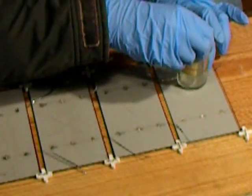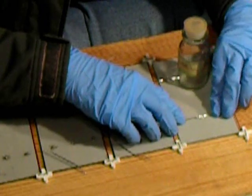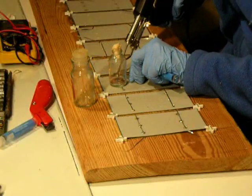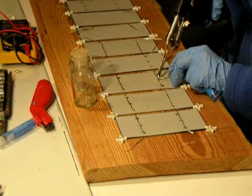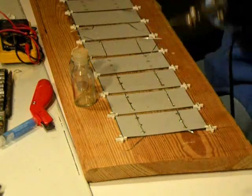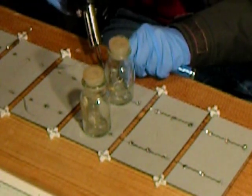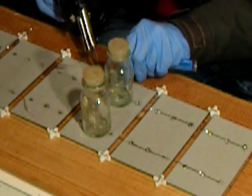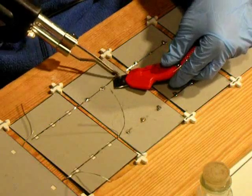Use weights to hold down the tab wires from the front of the cells over the white squares. Use glass weights instead of metal because the soldering iron acts as an electromagnet and will pull metal objects toward the iron. The type of solder to use is 60% tin, 40% lead, rosin core solder. Do not use lead-free solder because you will have to heat it up too much and may burn the back of the cell. To ensure a good connection, bring the tip of the soldering iron and the solder to the tab wire — do not heat up the solder on the tip of the iron, as this will cause a cold joint and a poor connection. Any faulty connections will cause the panel to not have maximum output, and overheating will cause the white square to burn away, requiring you to replace that cell.